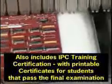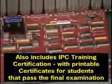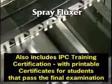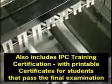There are spray fluxers, foam fluxers, and wave fluxers. The type of wave soldering system and method of flux application your company uses is probably based on the type of assemblies being manufactured. Spray fluxing systems employ either reciprocating spray nozzles or fixed spray nozzle technology. Both systems are controlled by a computer program to deliver flux fairly accurately to the width and length of the board. In either application, the computer will sense the board speed using fiber optics or proximity switches, and from this information calculate the coverage required.